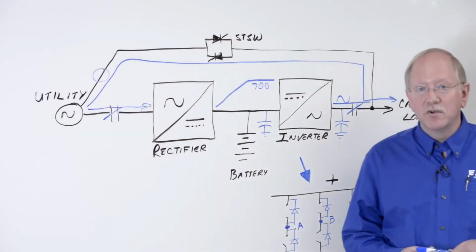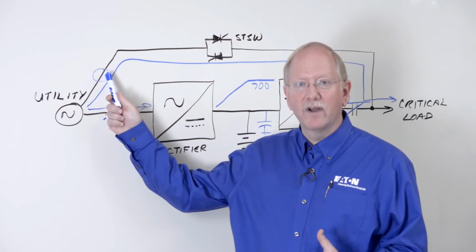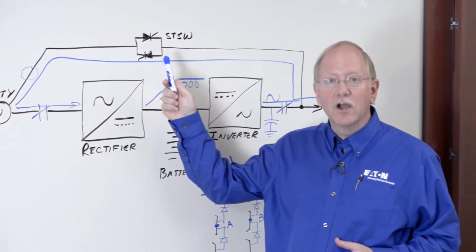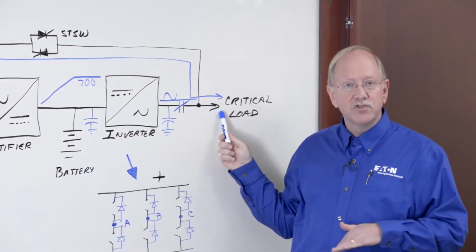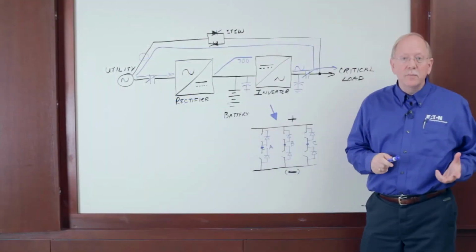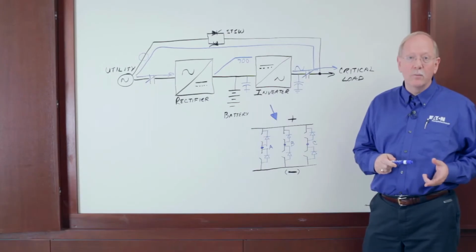So what the graphic shows is, even when we impress a 6,500 volt spike right on the input terminals of the UPS, and even though the static switch is closed in eco mode, we're able to attenuate that surge at the final output, shown by the green sine wave, to only a few volts. So in fact, the UPS is able to suppress lightning strike style surges, even in eco mode.